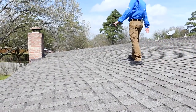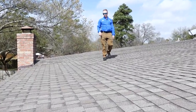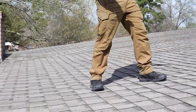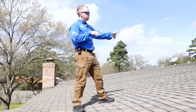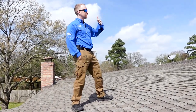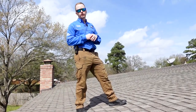Here's another angle of the roof — you can see how it has a wave to it, lots of angles, and you can see the pitting from this point of view. Whenever you're inspecting a roof, it's good to see it from a lot of different angles. Don't come up with an opinion too quickly — spend your time up here and do a thorough scan. From the ground level I was thinking 'great, a brand new roof,' but getting your feet on the roof lets you find leaks, improperly installed plumbing stacks, and more.